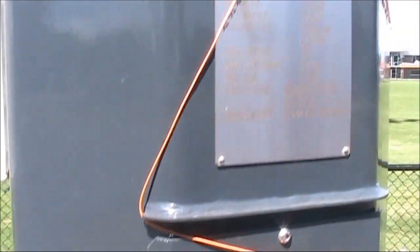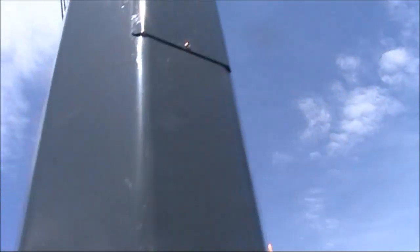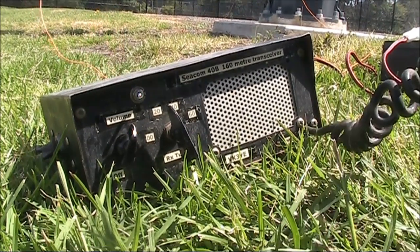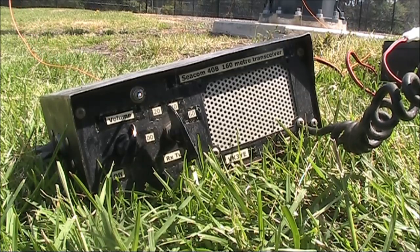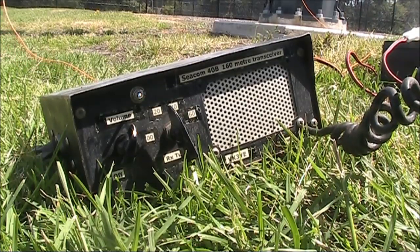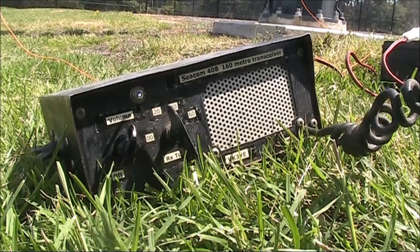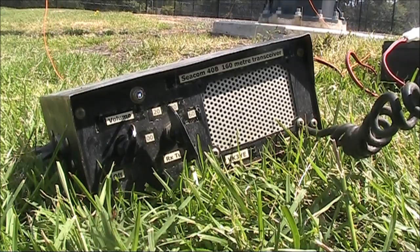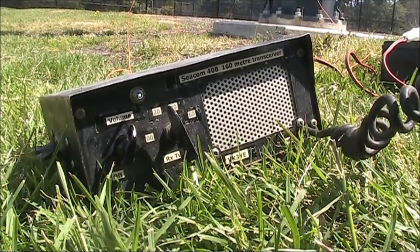I'll just tie the wire so that it's tightly coupled. The antenna I'm using now is a 26 metre long light pole that I'm trying to load up with a feed loop of around 7 metres parallel to it. I'm using two squid poles to hold the loop, one edge I'm trying to keep as parallel as possible to the edge of the light pole. I'm not using any ground — I've just got a loop connected to the transceiver, both the antenna and earth connections.